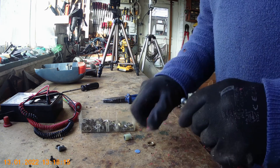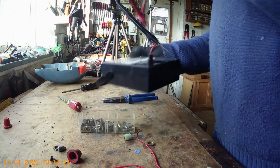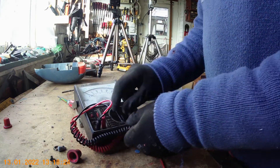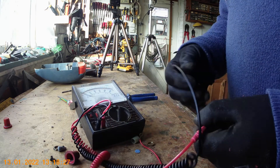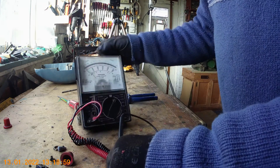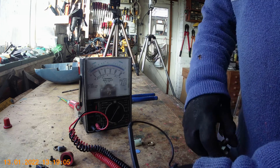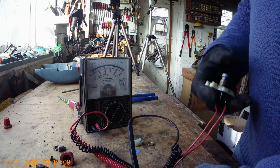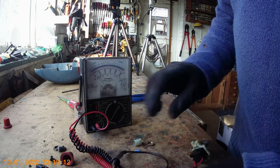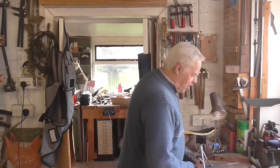A lot of people if they save things just dump it all in a big box and you can never find the piece you want. Now look — that's perfect. So now we're back to where we started: we've got a usable switch. What I'm going to do is just put the test meter on it to make sure it's got a circuit through it — I'll put it on the ohms range. The battery's a bit iffy in this meter but that's enough — it's working, we've got continuity. And it's off when it should be off. So we know the switch is now okay.